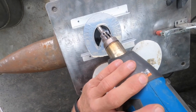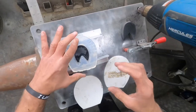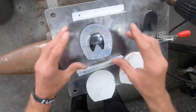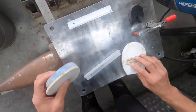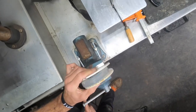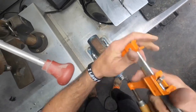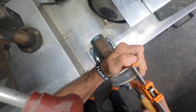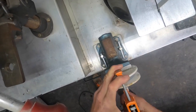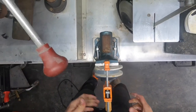Okay, we're getting close and good to go. Go ahead, flip the shoe over, push it into your plug so you don't burn your hands. Now we go over to our vise, sandwich it in, and use our C-clamp to push it in the rest of the way. You can see how that's pushing it in. It'll cool pretty good in about 30 seconds, maybe a minute.